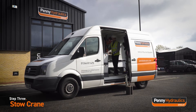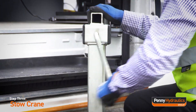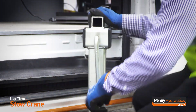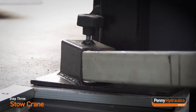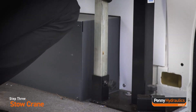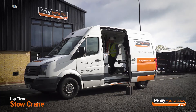Press the emergency stop button to lock. Detach the remote control handset power cable and stow. Turn the support leg crank anti-clockwise until it stops and is no longer providing support. Turn the handle anti-clockwise to release the support leg. Restow the support leg and secure in place by turning the handle clockwise.